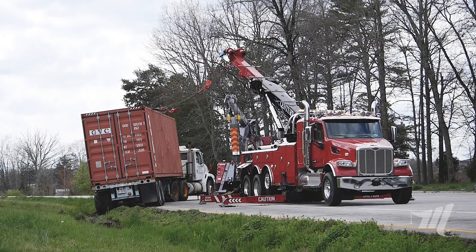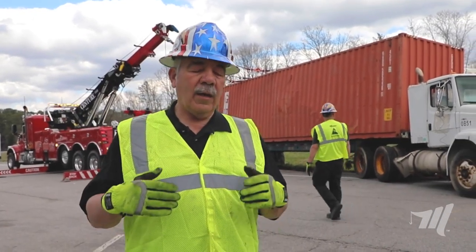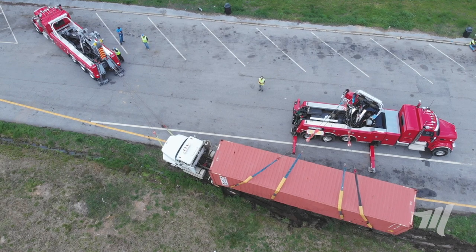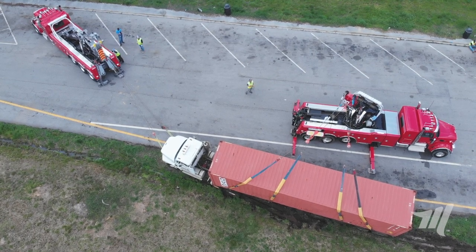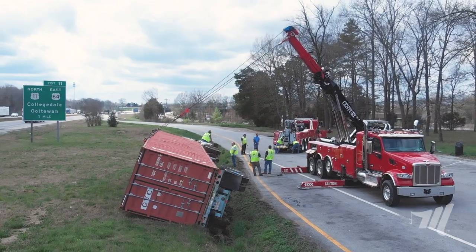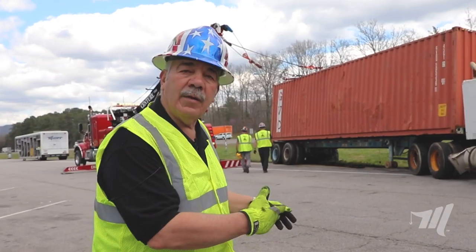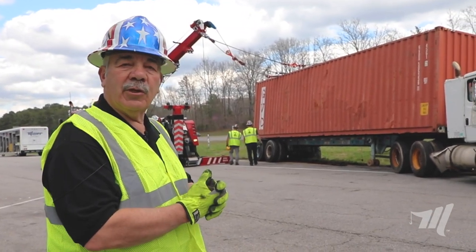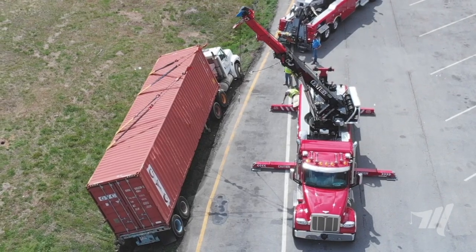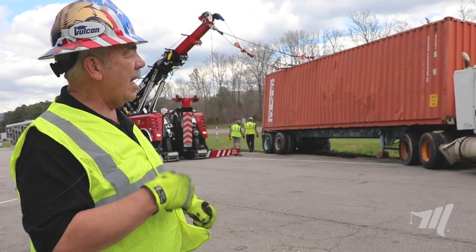Right now we can hook up to it, or if you want to take the rear line and pick the rear of the trailer up and bring it over, you can do that also. So that kind of ends our situation on winching towards us, stabilizing, rotating with the rotator, showing you the four-part line, showing how it all works, and operating with something actually in a ditch with mud resistance. You saw the landing leg — how we didn't want to go tight to avoid getting in a pinch — and we kicked that tractor around. In hindsight, the steering wheel being locked where it was, we could have turned it and got it out a little quicker. It fought us a little bit, but if you don't tie it at all, it'll kick the opposite way and give you resistance the other way.